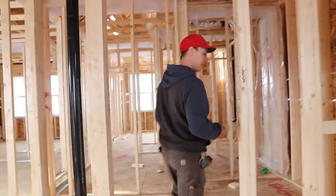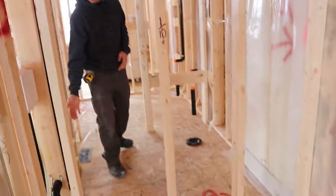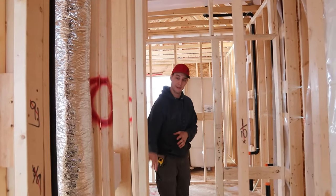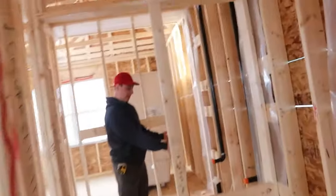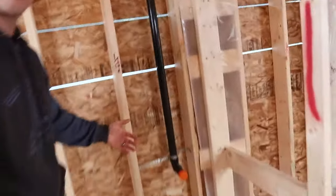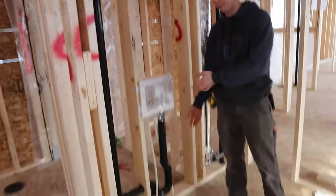And then we come over here to the main bathroom. In this bathroom we had the tub, toilet, and the two vanities — we have two water lines coming up. We haven't installed the tub yet; somebody else is coming in to do that after us, so we just got the drain and the water lines nearby and they're going to hang the valve and put the water lines in for that. Same thing for the double vanity, water lines are just coming up. This is an outside wall and we have freezing temperatures here in Canada, so we cannot come in the outside wall with drains or water lines. We also have a laundry box — laundry box, just straight down, two water lines — we've drilled our holes.